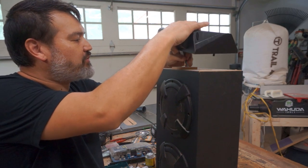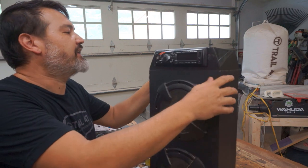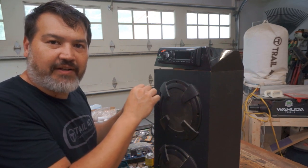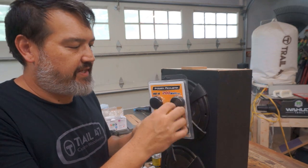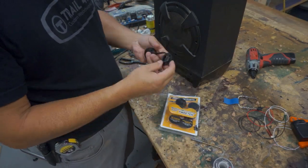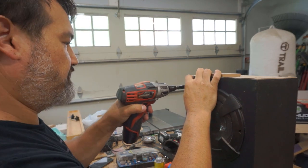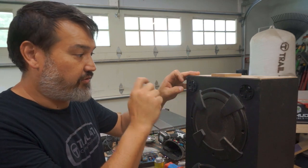We're going to check to make sure our wires will fit through the hole that we drilled in the top of the speaker box — and it does. The next step is we're going to connect the wires we used to extend the speakers up through that hole and connect everything before we screw it down. We'll also add our power plug somewhere in the back. While we're on the front of the case, let's go ahead and install the tweeters — at least the placement — and see what kind of wiring it's got. We might have to extend these wires too into the back of the speaker. We've got the mounting plate for the back of the tweeter, so we're going to stick those right up at the top with a screw right there in the center. We need to drill some holes in the bottom to run the wires through the case.